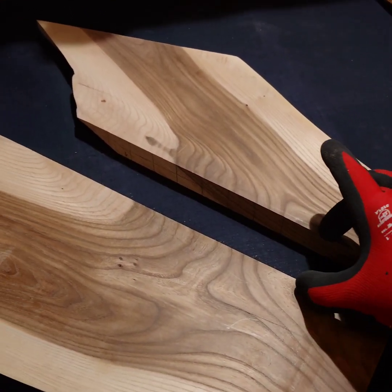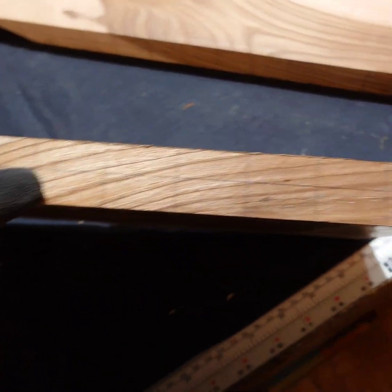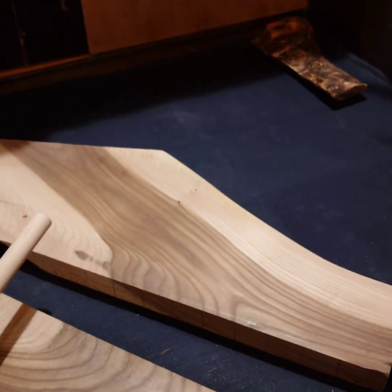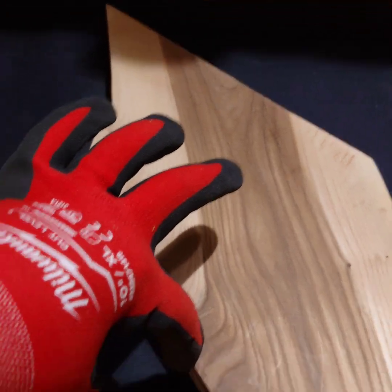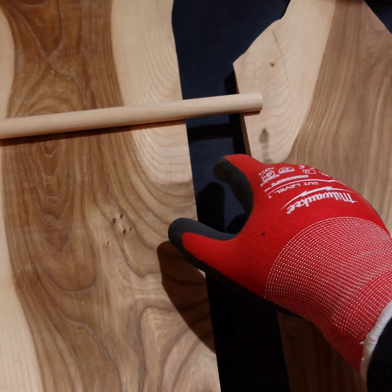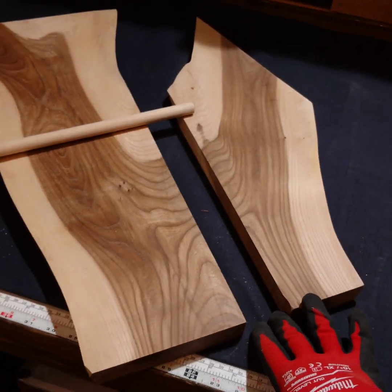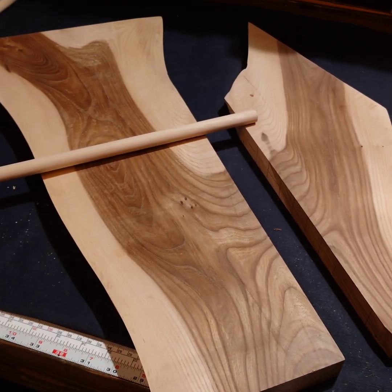I will make the epoxy be only in the middle, and I'm gonna make holes. You see the marks for the pencil. I'm gonna make holes in here, 16mm dowels. I'm gonna make them fit inside here, so it will be 3 centimeters between them, and then the blue epoxy will go in here with this inside them, so it will look like waves or something inside, pieces of wood inside the blue epoxy. So keep in touch with this project. I'm gonna finish it in a few days.